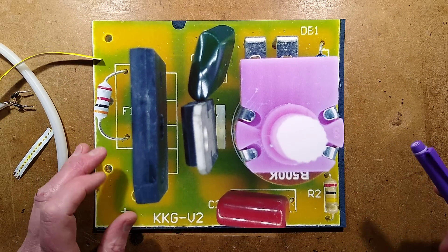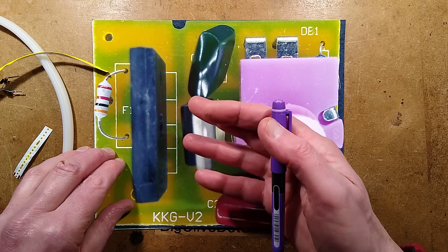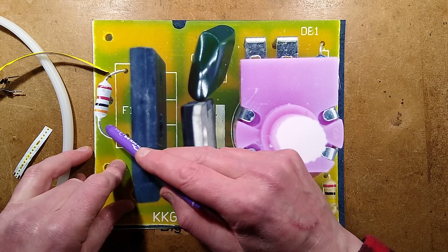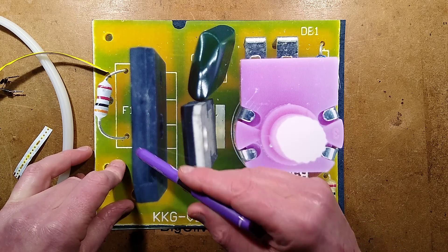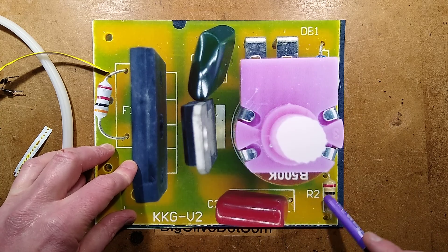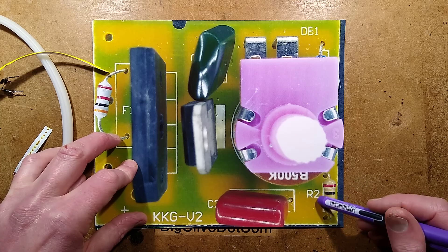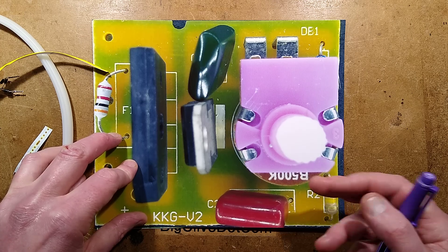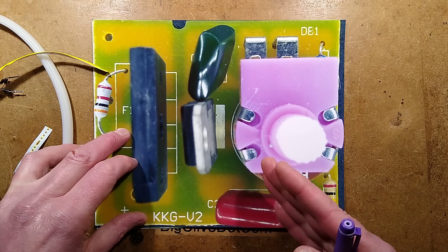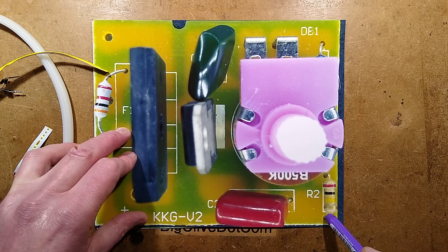Let's take a look at the hideous dimmer. It has what appears to be a fuse — I thought it was a fusible resistor, but it has a value of orange-black-red, which would mean 3,000 ohms, but it's a dead short, which makes me think it's 3,000 milliamps, so it may actually be a 3-amp fuse. That would fit because this bridge rectifier is rated about 4 amps. There is a triac, a timing capacitor, and a snubber network with a really oddly high-value resistor. I wonder if they just used the standard circuit and included it because everyone includes it, but with a 100-ohm resistor you'd normally use, the LEDs would just not go out even at the lowest setting. Even with the 200k resistor, that section glowed visibly — the current going through this capacitor and that resistor was doing that.